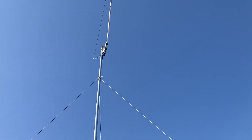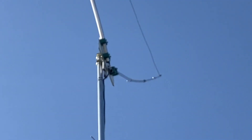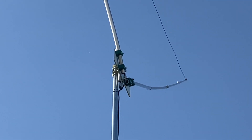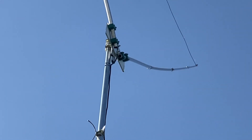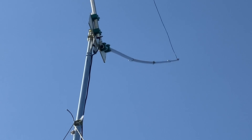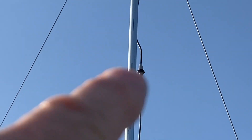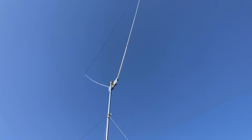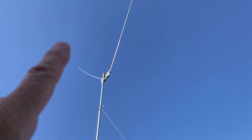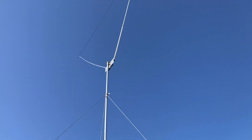It takes one-inch tubing, and if you look close you can see where the 75 ohm coax is connected — shield on one side, center on the other. The 75 ohm coax at seven foot three goes into a PL-259 connector, and my regular RG-8X coax goes into an SO-239. The reason I use 75 into 50 ohms is to bring the antenna impedance down close to 50 ohms — right at about 48 to 49 ohms.